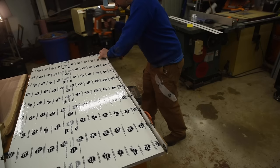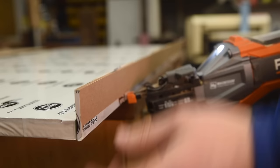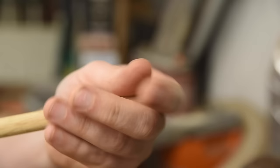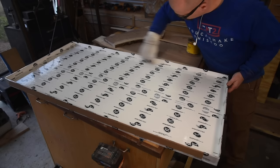Now that I need to buy some more tape to tuck with, I can start attaching the sides to the bottom. There's not going to be much pressure on these, and like me, they're pretty short, so I just attach them with plenty of brad nails. If you think this will leak and ooze — well, you're right, but some silicone is going to fix that. First I need to make a little tool to smooth the silicone; a dowel chucked up in my drill with some sandpaper makes quick work of that. Before I start siliconing, as some extra insurance, I pull out my shop sock and liberally wax the whole form.